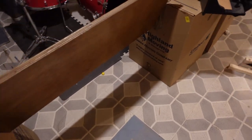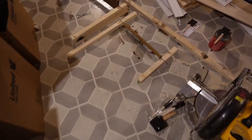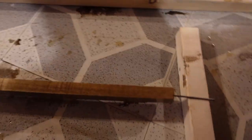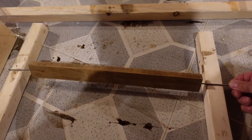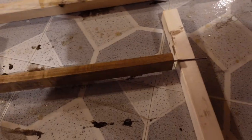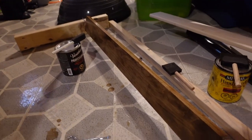To speed up the staining and clear coat process, I bang some nails into the ends of everything and do it rotisserie style so I can get both sides at once and cut my time in half. I use two coats of clear coat, and after the first coat I use 320-grit sandpaper before doing the second coat. I do that for anything where you can actually see it — if you can't see it, I don't bother.